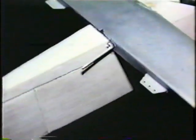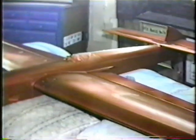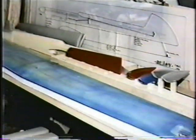And the basic idea that I want to start with, at least thought one on this whole video, is that an airplane doesn't start out looking real slick. It starts out looking real rough, real crude, rough wood. And step one in any kind of a nice finish is always going to be sanding the wood down flat. We'll refer back to these pictures a little later. Step one is always going to be get the wood flat.